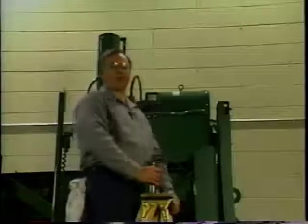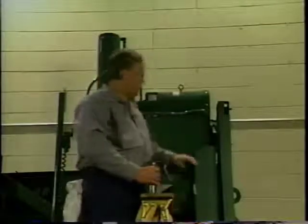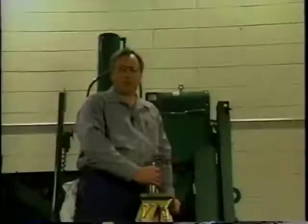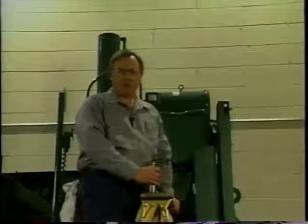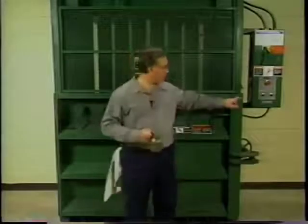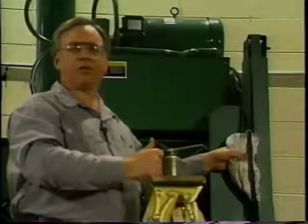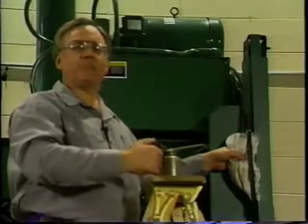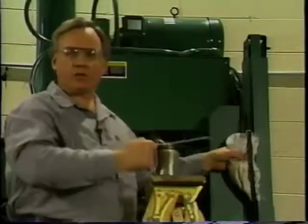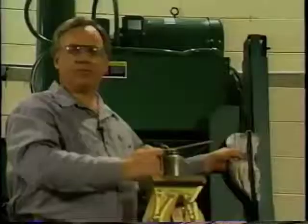With your grease gun, give grease to the fitting above the fan in front of the electric motor — these provide lubrication to the motor bearings. Check the thickness of the platen's guideways. When new they're a half inch thick; if worn down to a quarter inch in thickness, they should be replaced. If you measure somewhere in between, give them a coating of grease. On the lower half of the baler, oil should be applied to the bale door and door lock hinges. Any spring-loaded dogs on the bale door should also be oiled. The annual inspection includes analysis of the chains connecting the safety gate to the counterbalancing weights. Besides providing an even coating of oil over the surface of the chains, check the master links to be sure clips are tightly intact. Also check the condition of both sprockets for wear. Repair or replace parts as needed.